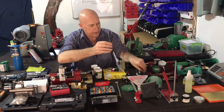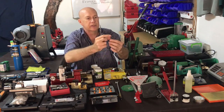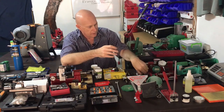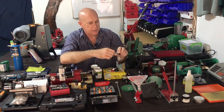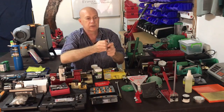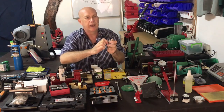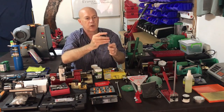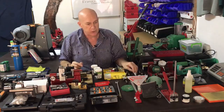There are a couple of variations in the flash hole uniforming tools. These are handheld — this is for a small flash hole and these are for the larger ones. There are also some others that can be adjusted according to the length of your cartridge, which serves the purpose very well.